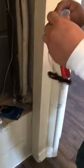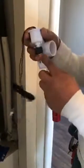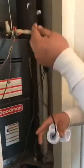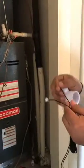We got two wires coming from the flow switch. All it does is it has a little float piece — when the drain pan gets filled up with water, this will float. These two wires are gonna be hooked up to the wires going to the outside unit, and when the floater rises it's gonna shut off the signal to the outside unit, so the outside unit will shut off.